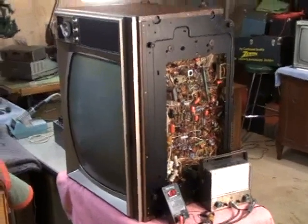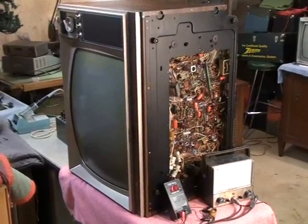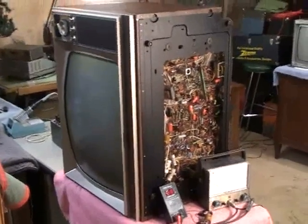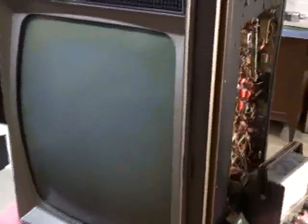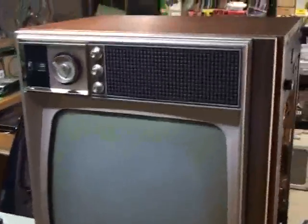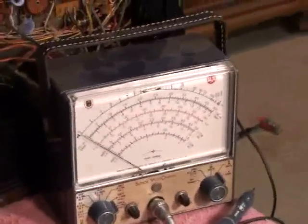This is video part 2 of the 1969 Zenith model Z4507. If you recall from part 1, the CRT displayed very short vertical sweep, and that needs to be corrected. We weren't able to adjust it with the vertical size and linearity controls — we were a little short on the bottom. Now we need to analyze the vertical output circuit and pinpoint where the troublemaker part is.